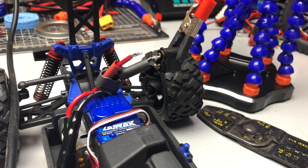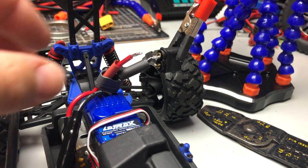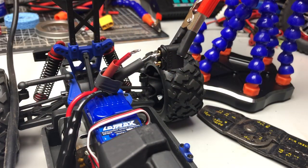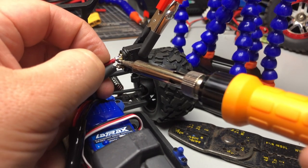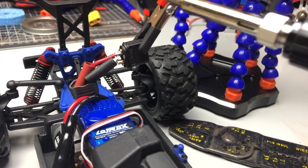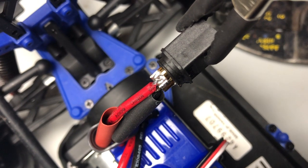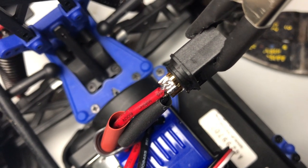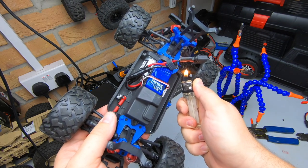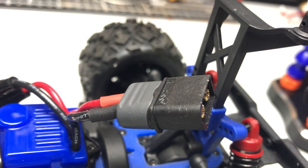If you want to fill it up a bit more, use more solder and warm it up as we did with tinning. But that joint is not going anywhere — it's a solid connection. You can just about see the core of the cable which is fine, absolutely fine. Remember it's really important to get the right polarity on these, otherwise you might do some damage. So you saw how easy that was — it's all about tinning the cable, tinning the connector, and getting the right temperature on that iron. One good solid XT60 connection done.